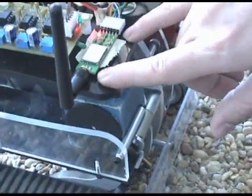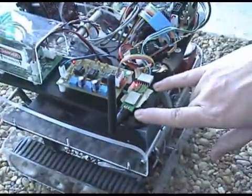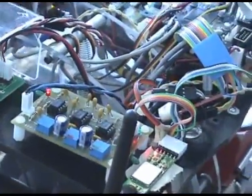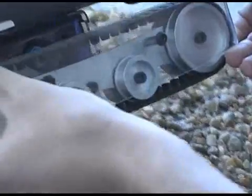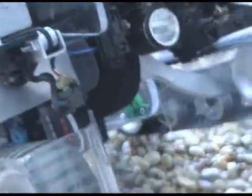This is a Bluetooth serial link so that we can debug the robot software while it's running. And under here is a wireless PlayStation 2 receiver from Logitech that we integrated for driving the robot around manually for debugging and development. Our power system features a Dell laptop battery that you can slide in and replace easily. It's also got the indicator lights on it so you can tell if it's still charged or not.